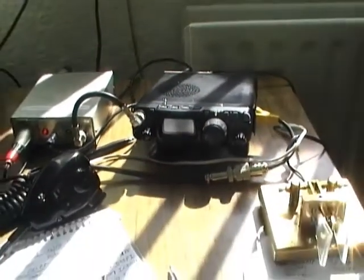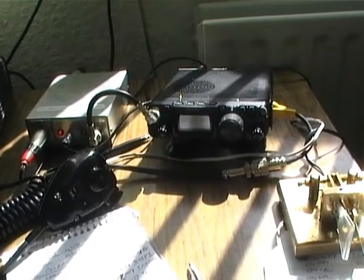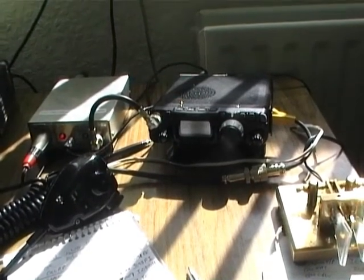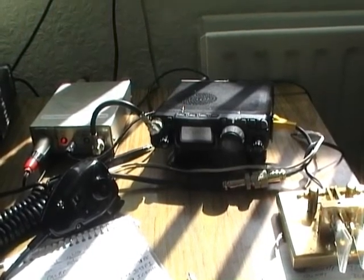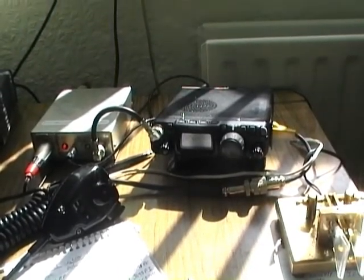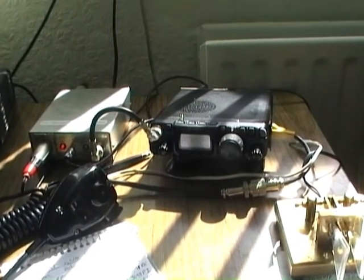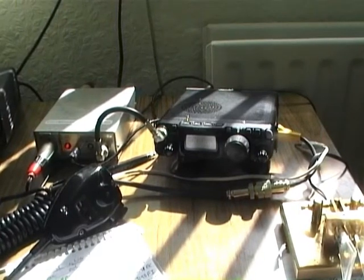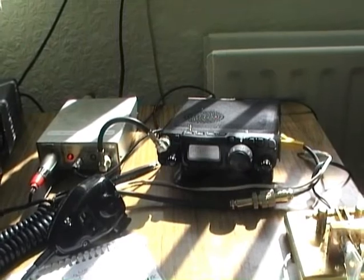That's the Manchester Beacon on 10 GHz, on 10368.810, from Manchester. But I'm beaming due south to get that, because the signal is getting scattered off a rainstorm cloud, probably a thunderstorm to the south. I can hear it directly if I beam west, but it's no stronger and still has the rain scatter propagation.